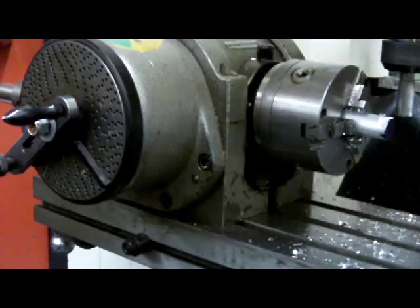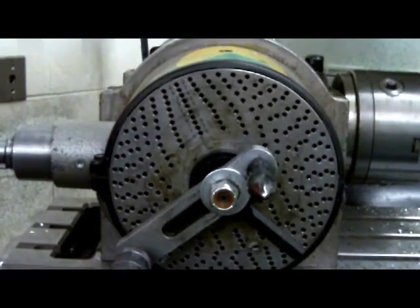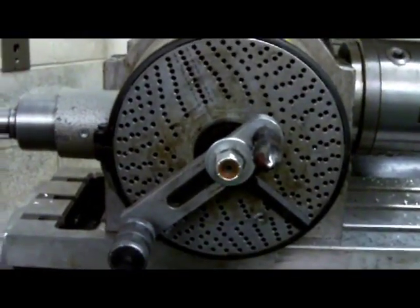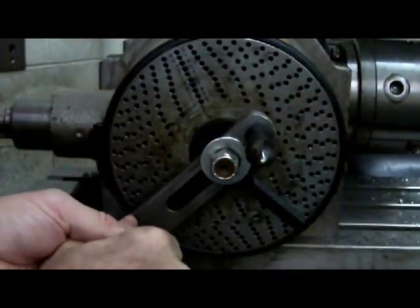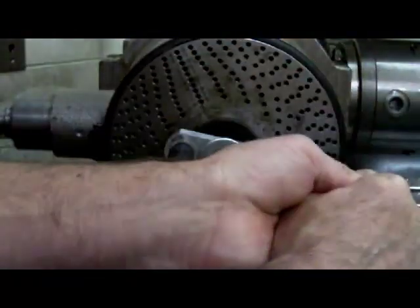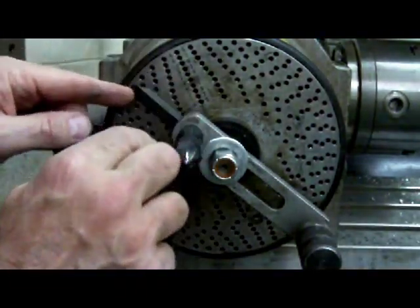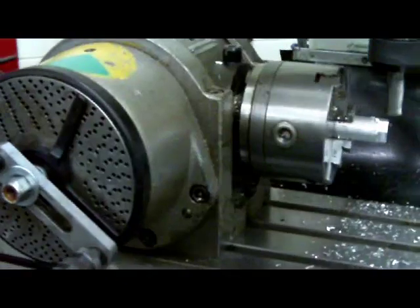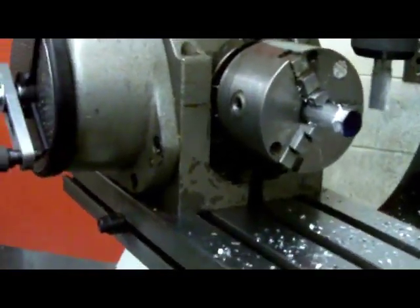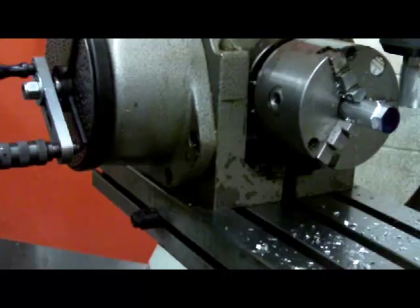Make sure the cutter is clear of the work. I'll bring you around so you can see what's happening with the hole plate. Ready to cut the third flat — pull the crank pin, go clockwise: one, two, three, four, five complete revolutions and then five-sevenths of a turn. Set the sector arm — always use the one that's going to sit up against the pin. We'll come back around and have a look at how the part is looking. I'll just leave the camera there because you've got an idea what's happening with the indexing. Third flat.